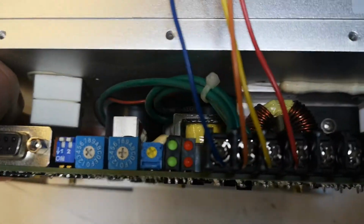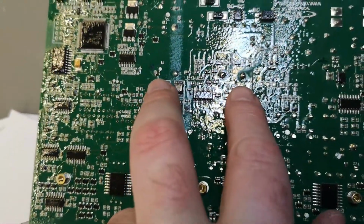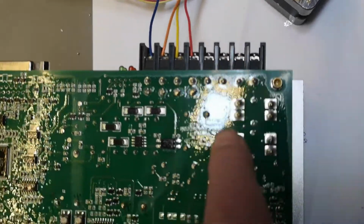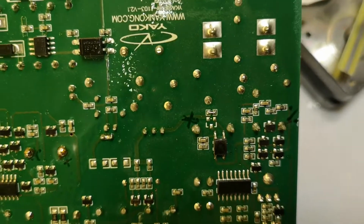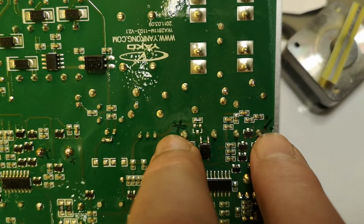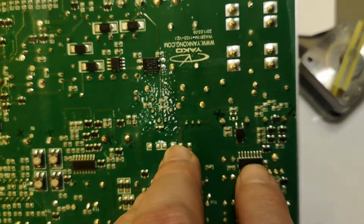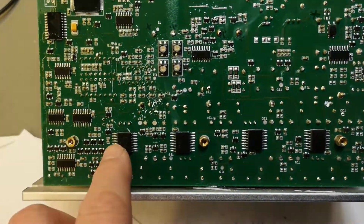And you see 2 big capacitors in there, the 2 black ones. They are here. And what I already figured out is that when I input my DC here, it goes to the bridge. I don't know if that is easy to see due to the light, but now you can. So this is the minus and the positive. Here I get my input voltage, but it's not on the capacitors. So there's something in between that is to blame for the problem. So this we need to investigate.